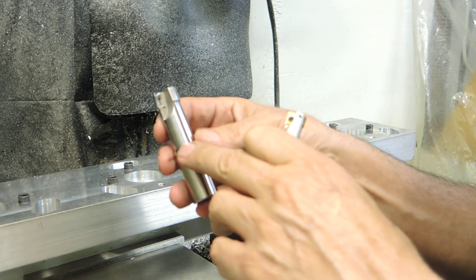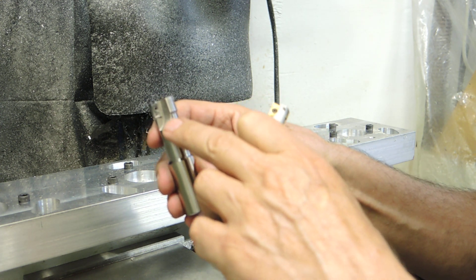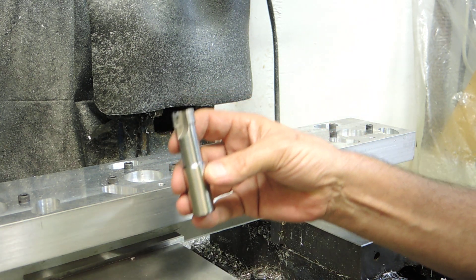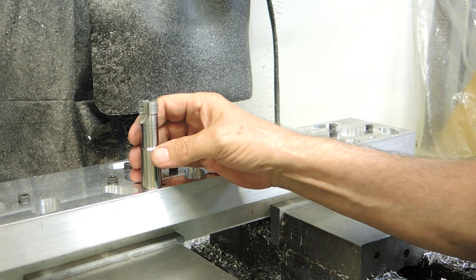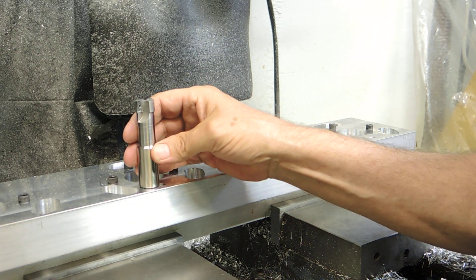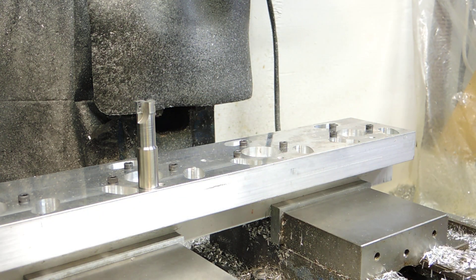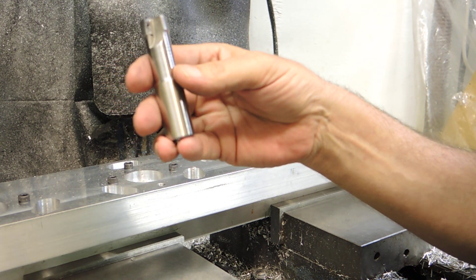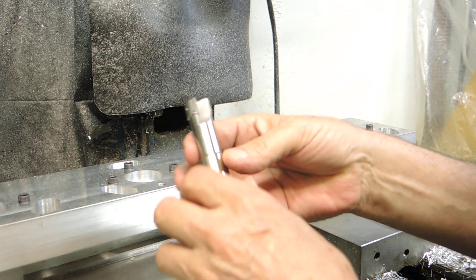Some of these are really hard. On this one I put a shoulder because I'm doing slots and I needed extra room to get the chips out. It has special aluminum cutting inserts. It's a 20 millimeter shank and it cuts 20 millimeter diameter. They make them like 21 and 22 millimeter cuts with the same shanks.